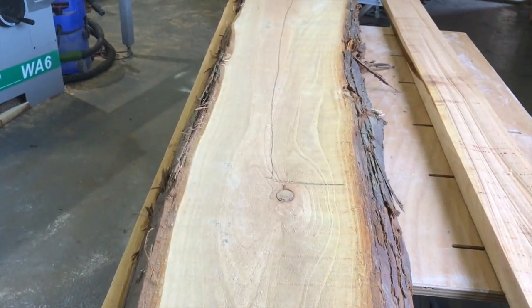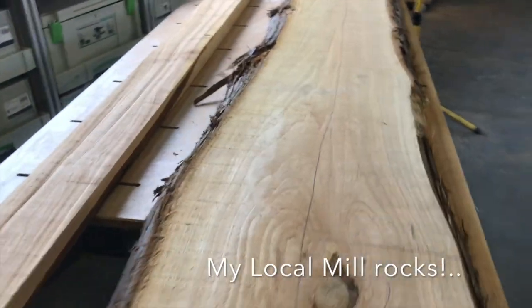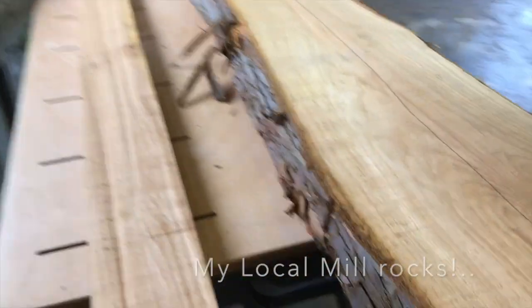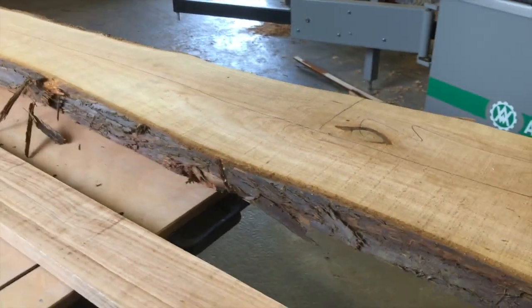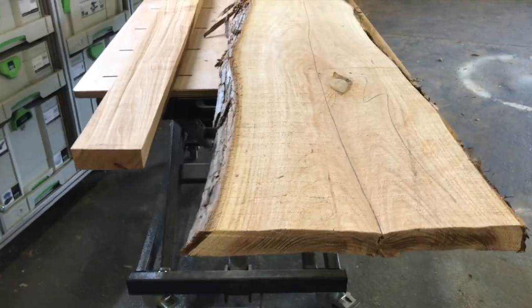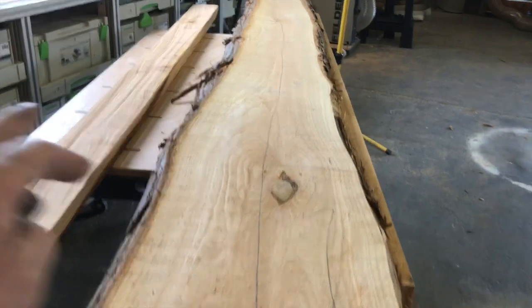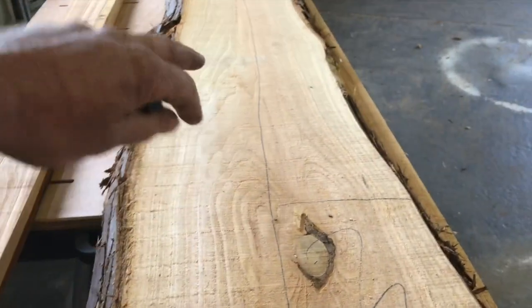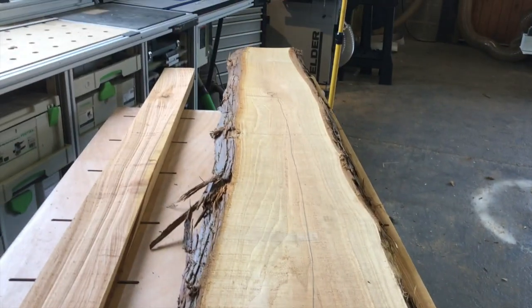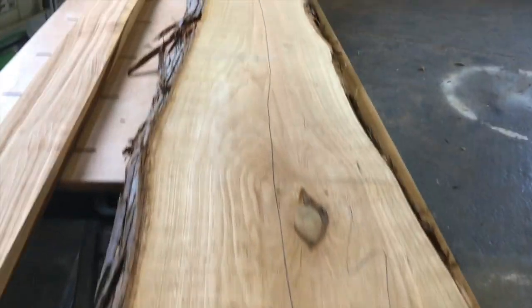Now what that impacts is obviously time. I've got to mill all this myself, but it is much less wasteful and much better generally for the environment when you're hand selecting and you've got the time to do this. That's one of the key benefits to buying this lumber, which they call sawn through and through, which is basically the plank with the wany edge. And then you machine it yourself and you can go for this super cost saving but time incurring selection.